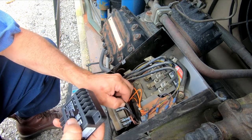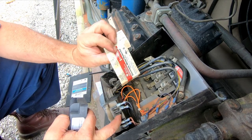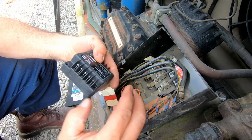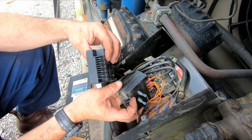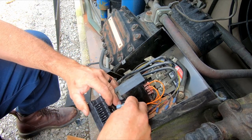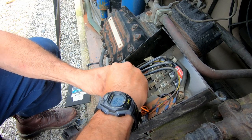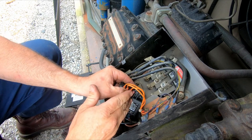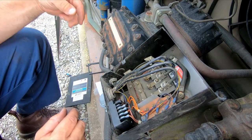So we've got two wires here, which were for the voltage coming in, L1, L2. So we'll just copy that right there. They do not give you hardly any extra room whatsoever. And all that is a bunch of thermistors and the windings. And it's monitoring that temperature, and based off of the resistance, it knows what that temperature is, and that's when it decides to call it quits or not.